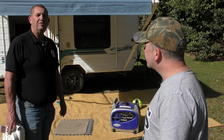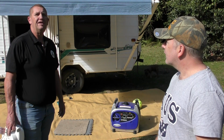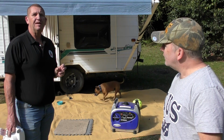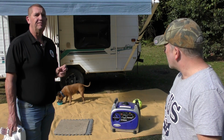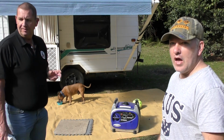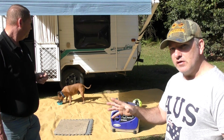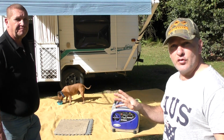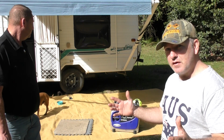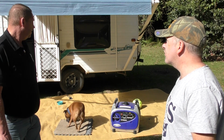Mind you, with the new Hondas apparently, which are now 2.2s, are they? Okay. They will run most air conditioning, modern air conditioning. Pretty much anything, yeah. Older stuff maybe not. But they assure me with a 2.2 you can run any modern air conditioner in any modern caravan. Yeah, and because a lot of your new air conditioners are soft start as well, they don't have that big load that they put onto the generators on startup, which is often the case where the little bit bigger comes in handy. But if you don't have that requirement, no big deal. You probably wouldn't have any issues just with the 2, I wouldn't imagine.